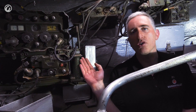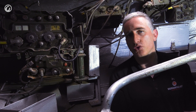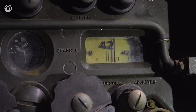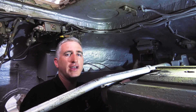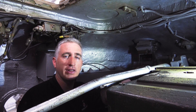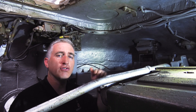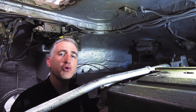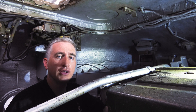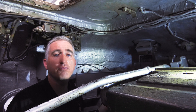The loader is also in charge of the radios, which are located on his side. Initially he was fitted with a Number 19 wireless set of World War II era, and then a Number 88 was also added a little bit later. To the front of the loader, he does have one way of looking out short of sticking his head out the top, and that is the periscope, which is adjustable in elevation and also rotates. You'll see if you look on the outside of these periscopes, you also have a visor to keep the sun glare off. To the right are the mounting points for the two machine guns — the caliber 50 ranging machine gun is the larger mounting on the left, and to the right is the caliber 30, which is effectively a 7.62.